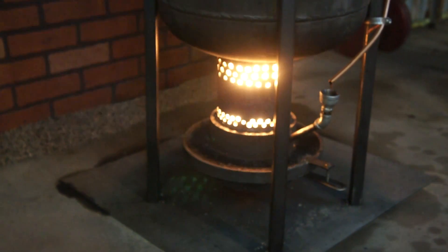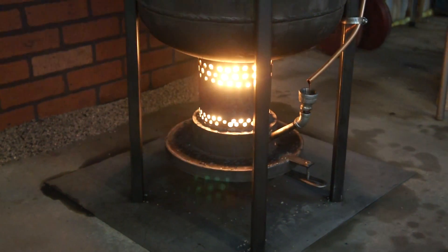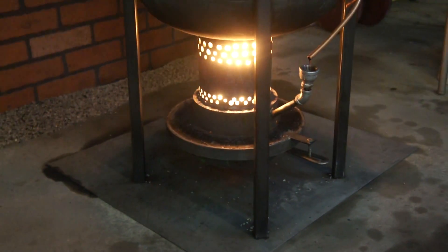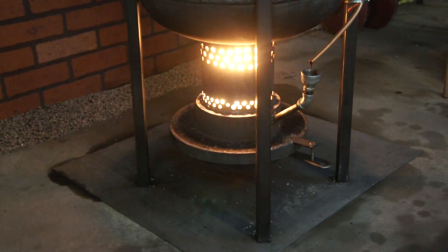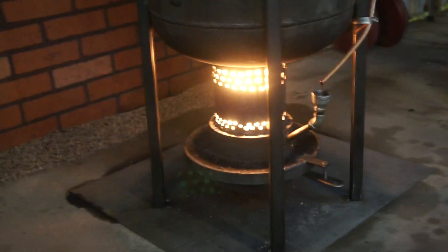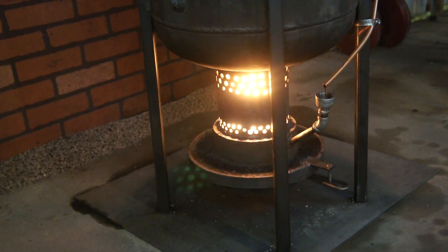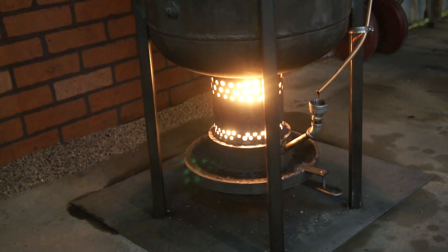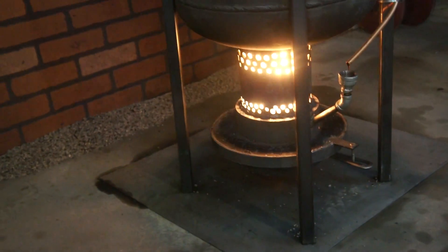We get an extremely clean burn now. We had a problem with light soot — having to clean the heater often, soot in the chimney, and if the heater was tuned wrong or the fuel rate was off, we had soot outputting out the chimney, which makes a mess. We had to upgrade to a larger diameter chimney to get velocity up. Every time we went to a bigger chimney we lost some efficiency and had to put more fuel in, but in turn the unit operated cleaner. We now have no smell in the shop whatsoever from this unit running — people ask about stink and you can't even smell it operating.